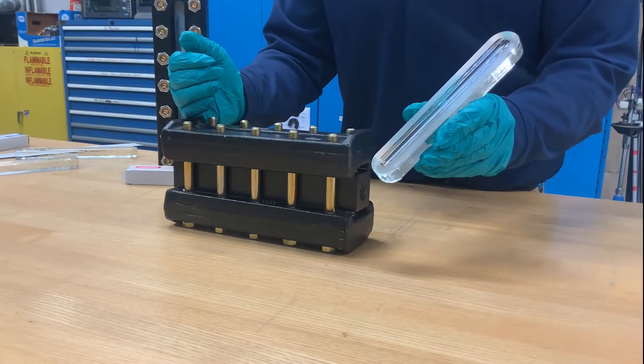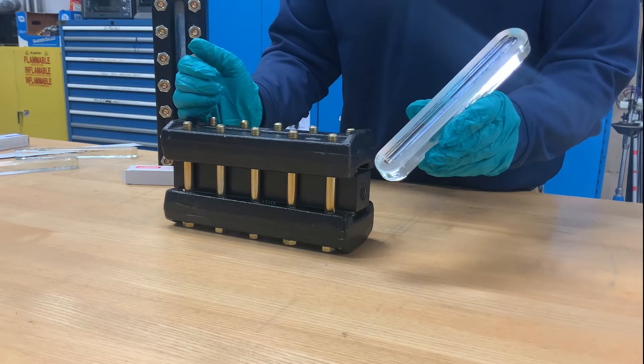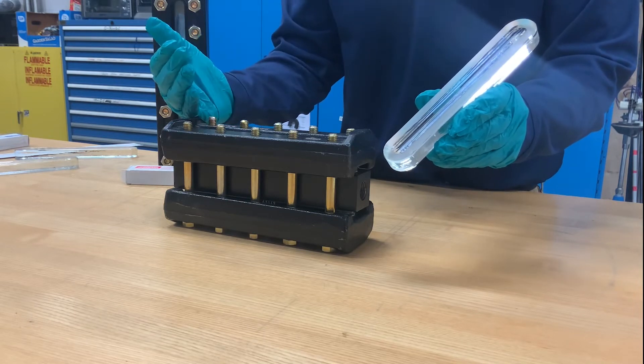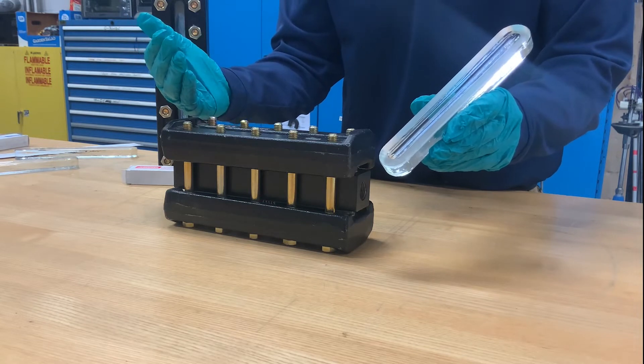Mica can only be used on a transparent piece of glass. Because of the ridges on a reflex glass, you cannot use a mica shield. It is recommended to not use reflex in steam service over 300 working steam pressure. For transparent gauges, anything over 300 working steam pressure should have a mica shield as protection.